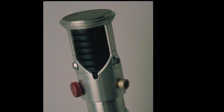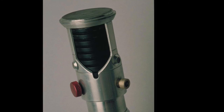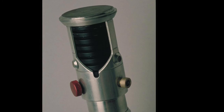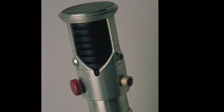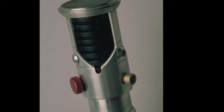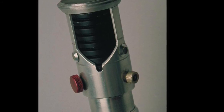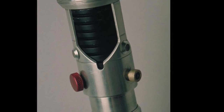Moving on. Here's a really nice reference photo and this tells us multiple things. To continue talking about the emitter, you can really see that fender washer a lot better here. And you can also actually make out the outline of that steel rod around which the saber was built. This is the photo I used to scale that steel rod — basically using my calipers with the known dimension of the one and a half inch fender washer. That's how I got three-eighths of an inch for the steel rod.